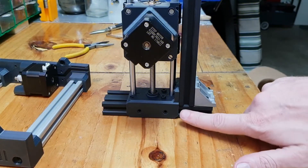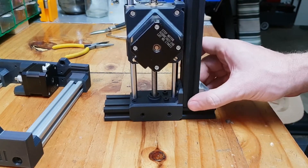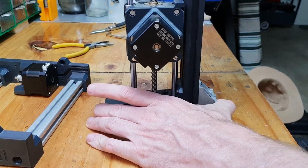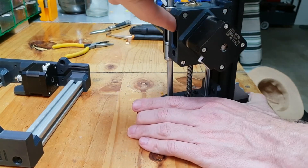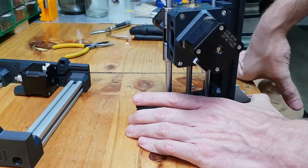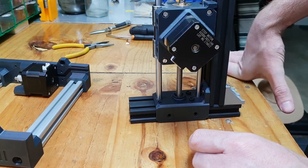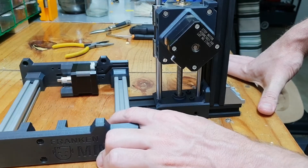After cutting it down I already assembled it. I used some corner brackets to give it extra stability because this is steel — obviously plastic is not going to be able to keep this extrusion stable. If I try and move this, it's pretty solid so I don't think it's going to have a problem when the hot end is hanging on the X-axis. I also painted it black — I think it looks pretty cool. Our next step is to then assemble it to the Y-axis.